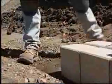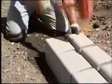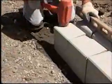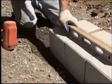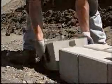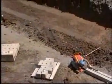Always begin laying the block at the lowest elevation of the wall. Landmark foundation units are 190mm high with a smooth finish on all sides. One method of placing the foundation block is to place the block side by side, flush at the front of each unit. Always make sure the blocks are in full contact with the leveling pad. Use your level front to back and side to side, and for best results, use a spirit level along the length of the wall.